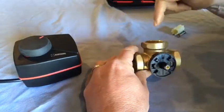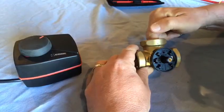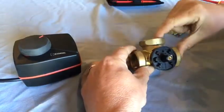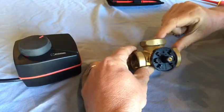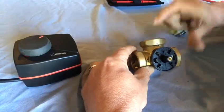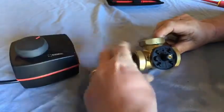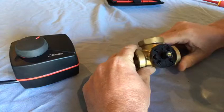The golden rules: we never put the flow pipe into the branch - it can go into either end, and the other two ports can be hot water and heating any way around. It's basically 50/50 if this is set correctly for how you pipe this valve up.